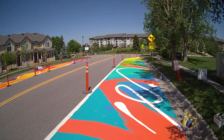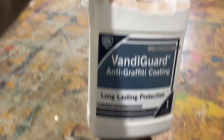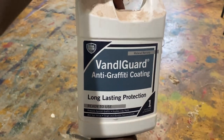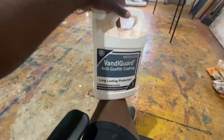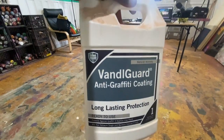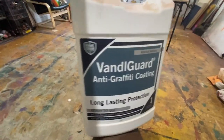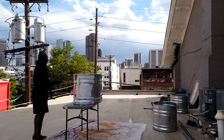When I finished, I added a vinyl guard anti-graffiti coating to the surface. I was able to just roll it on — got about 10 gallons of it, threw it on the ground, and rolled it around. It dried really fast, but you have to keep rolling it so it doesn't get a milky film. This was a first for me, so I'm going to keep documenting it and see if it works.